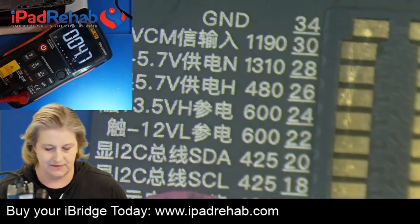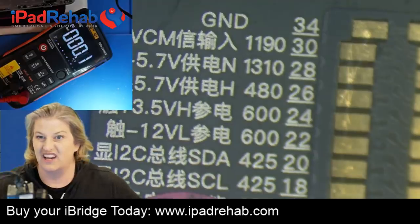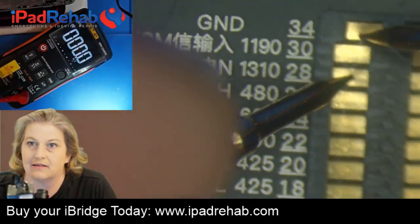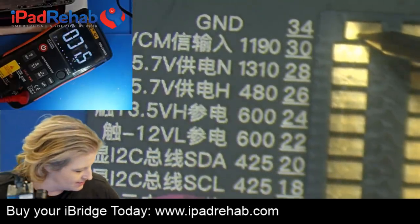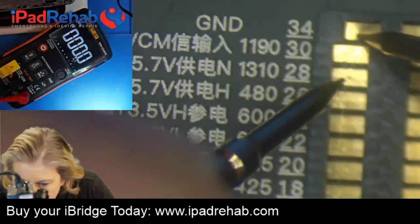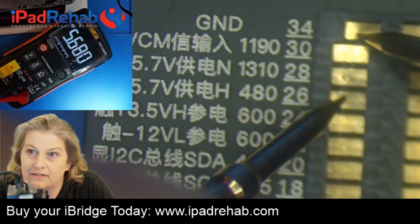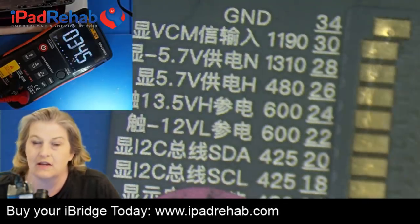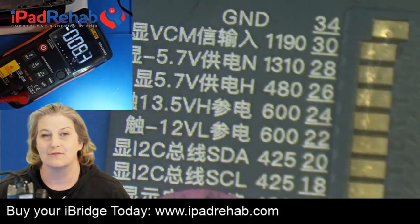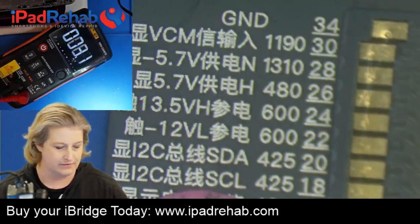So I keep these sort of connected either to USB, so I can do a lot of this. Unplug, plug. I know that would be the prompt to wake up the screen. So real quick before it sleeps again, let's take this reading again. Oh, did it sleep again? That'd be even faster. All right, see, there we go. 5V7, 5V7. So these are positive and negative 5V7. So that's a good lesson there to not ever be tricked. You gotta keep your screen awake, which means it's really probably best to take these measurements while the thing is booting up. So let's go ahead and do that.